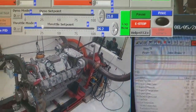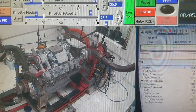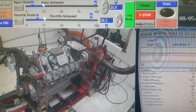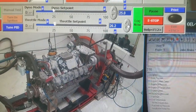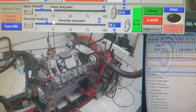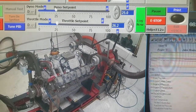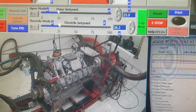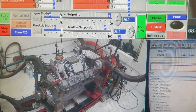we've got a 2000 series which we've been dynoing up. This is the old 2000 series, one of the first versions to come out. They've changed a lot over the years. This is the one with the unit injector. You've got the pump in the valley and then they run the high-pressure lines to the injectors under the rocker covers. The new 2000s are now common rail, a bit more fancy.